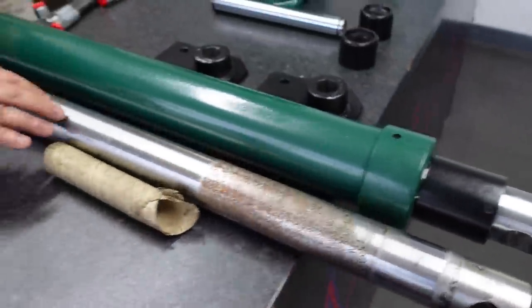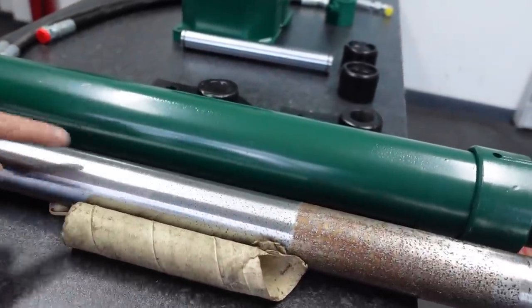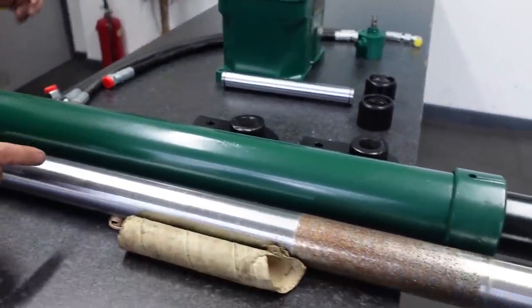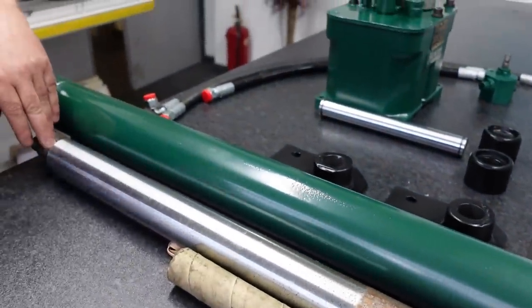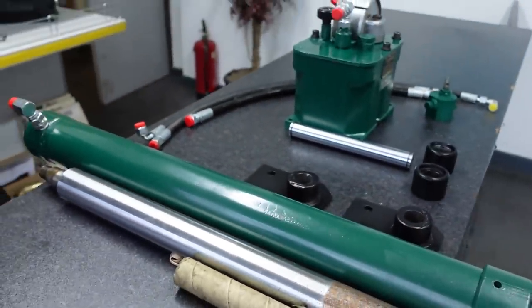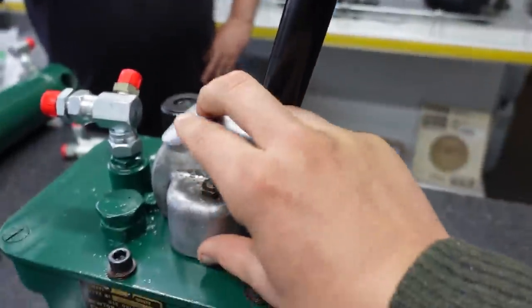So this was the original rod, but it didn't seal properly - the problem was all the pitting and perforating. What could eventually happen is the rubbish gets inside and scores the tube. Rather than take the chance, we did polish it through, but where it's pitted, that would rust again in seconds because it's going to be outside. So we've made a brand new rod. We've cleaned all your tube up, resealed it and put your collar back on - that's the original collar and this is a new rod. We've taken it right out, made a brand new one, put a new piston on it with new piston seals. We polished all the inside of the tube so it's nice. The tube itself is the original - we just cleaned it up.